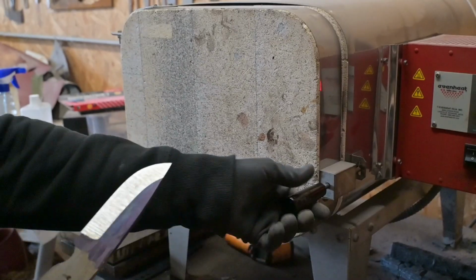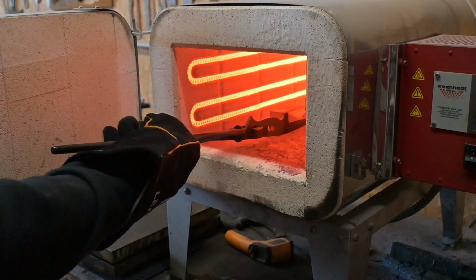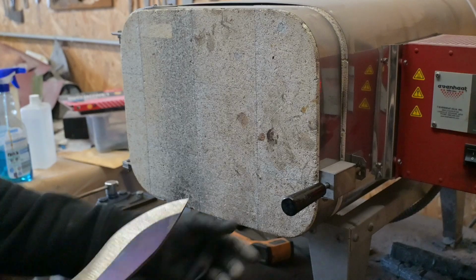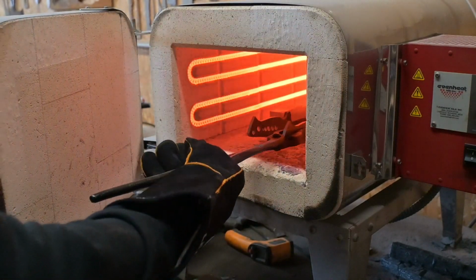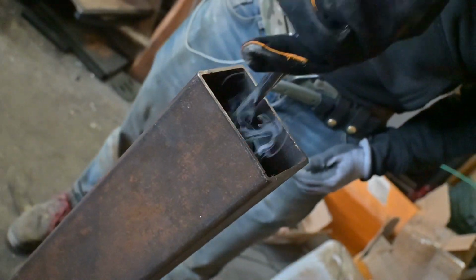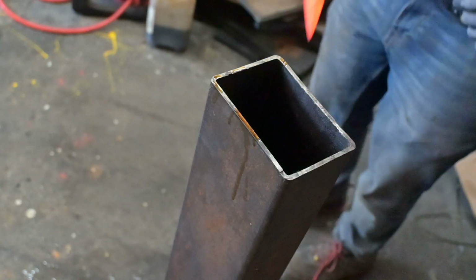Heat treating 80CrV is actually quite easy and you don't need a heat treating kiln. It's a really nice starting steel, so you can also do it in a forge or in a fire. I have also made a video where I show you how to heat treat a knife in a forge. Of course, it's not as exact as a heat treating kiln.